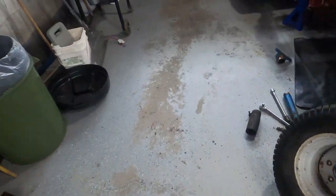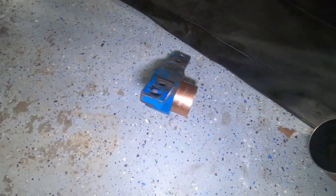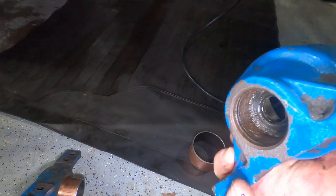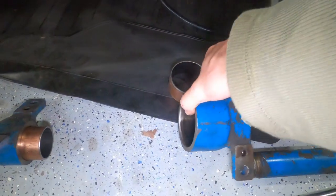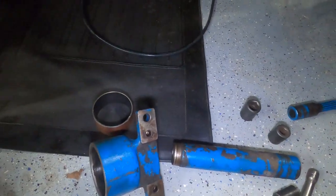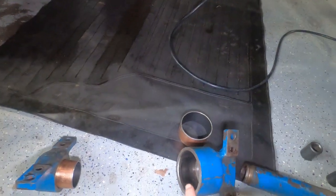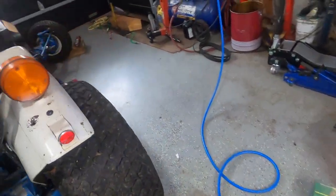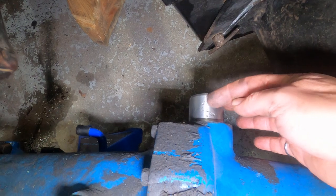As far as the front goes, same thing here. Everything's good. Oh, there's a seal in there - I think I'll leave that. It's really easy to knock out, I just didn't get one. And an O-ring. I had no oil leak back here. I'm going to make sure that's thoroughly clean and probably pack it with grease. Because there really wasn't a problem of leaking out the back - they were coming at the O-ring surface right here, not out anywhere else. This would probably pool up a bit of oil if anything. So not too worried about that.